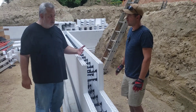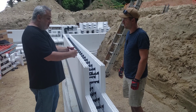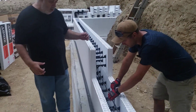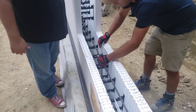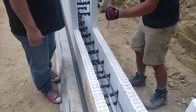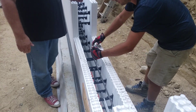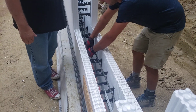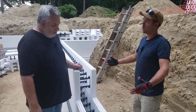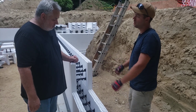You're not going and finding a place to get those bent or made. When the blocks come together horizontally, there's a clip right here — same thing, it clips in nicely. Typically we do one vertical clip per block and then horizontally clip to the next block, which is also clipped vertically, so those are pretty much on four-foot centers. You don't overkill it, but it helps stabilize. We do a lot more for the first two courses, which is very important because when we place the concrete we go three courses at a time, but the most pressure is in those first two blocks.